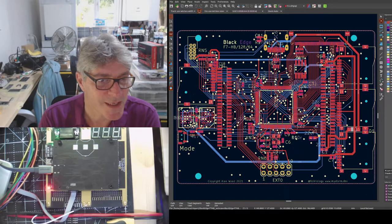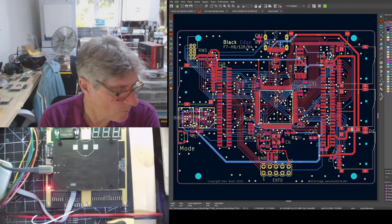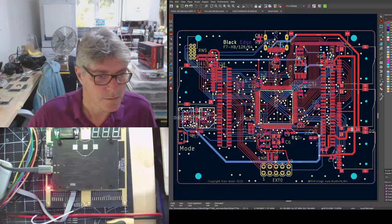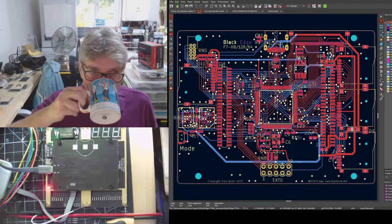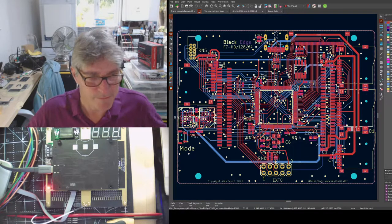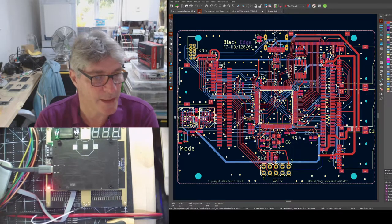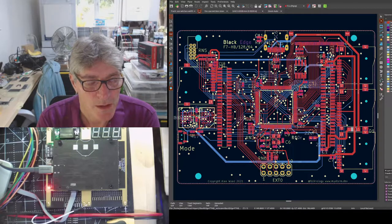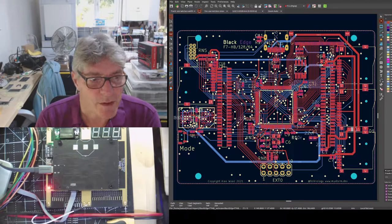One use was an ADC PMOD that needed it. Really? An ADC that needed 5 volts? Did you need a 5 volt analog input or something then? But 5 volt pins are a bit dangerous. Yes, they are. Especially when they're adjacent to pins that can only handle 3 volts. Which is a negative to putting the 5 volts on there.